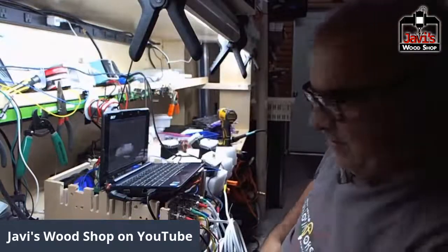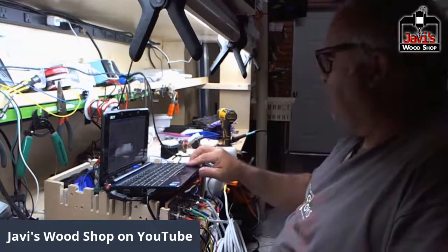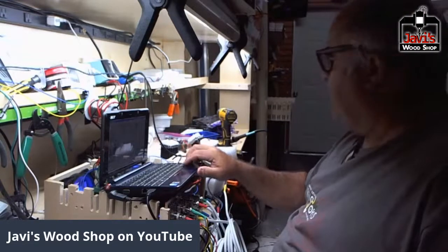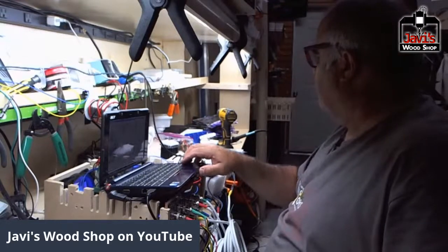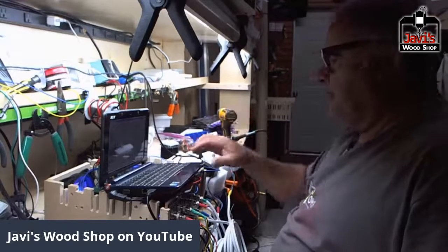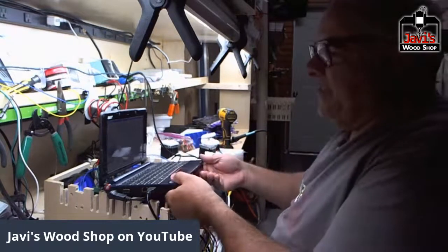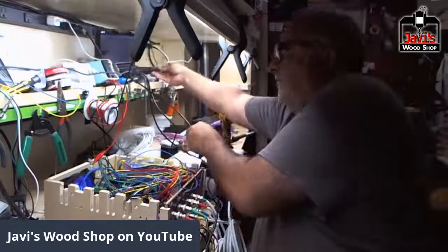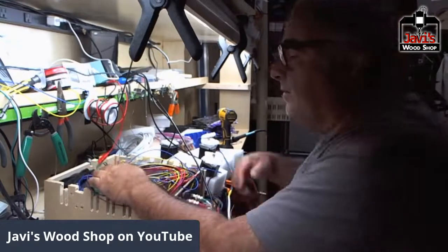Now let's try the motors. This is Jason Spiegan's box. Motors. The X. Right. Left. Good. The Y. Right. Okay, and the Z. Okay, both Y's need to be reversed because it's in the wrong direction, but we'll take care of that real quick. It's just a matter of flipping a couple wires, folks, so happy to do that. It's always something, you know, always something. All right.